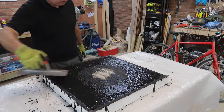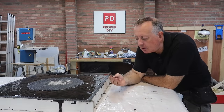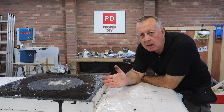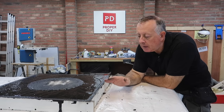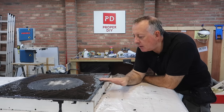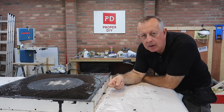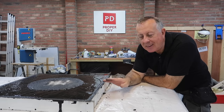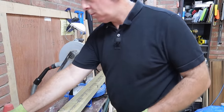The concrete is poured, but I must say that black dye gets absolutely everywhere and stains anything it touches — your hands, the floor, your clothes. At the same time I'm glad I put it in because I don't like seeing bare concrete colour in the garden. I'm going to leave it for an hour until it gets the initial set, then cover it with polythene and a thermal blanket to keep it moist and warm. In two or three days I'll take the sides off, and in about seven days it'll have enough strength to be taken out of the mould. While the concrete was curing I turned my attention to making the timber trolley.